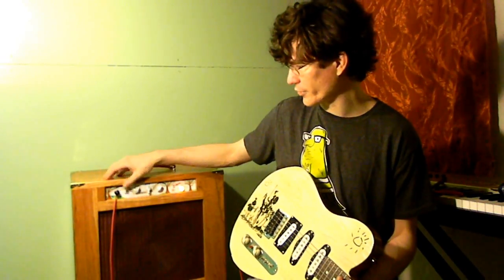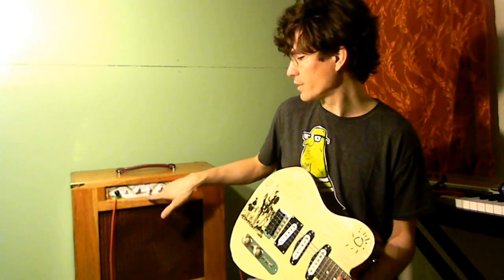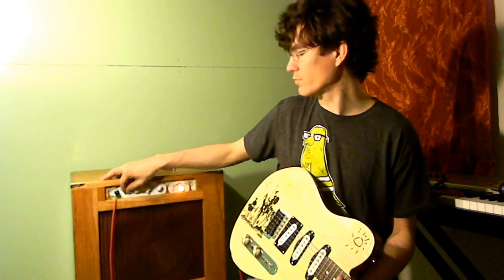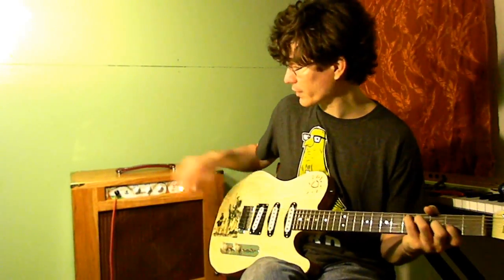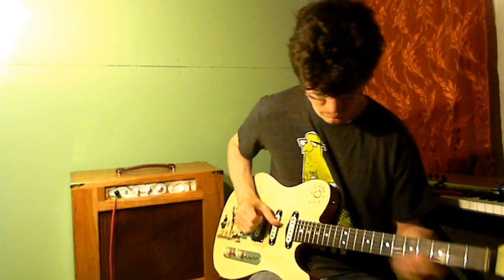I'm going to start off in the original Champ's setting, mid-range all the way down, so it's basically out of the circuit. Treble control a little bit past noon, which I think is going to sound a lot flatter, and the voice control on the negative feedback's normal negative feedback setting. And here's the volume at noon.